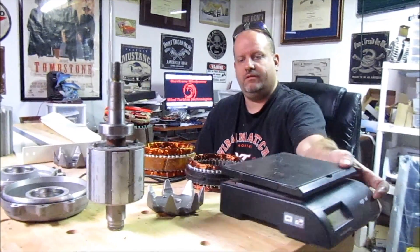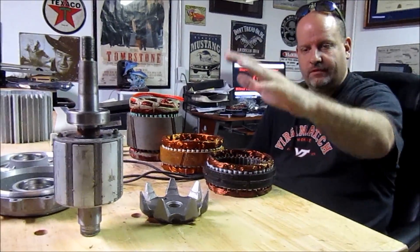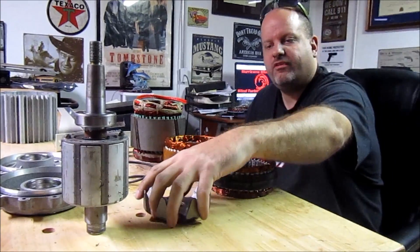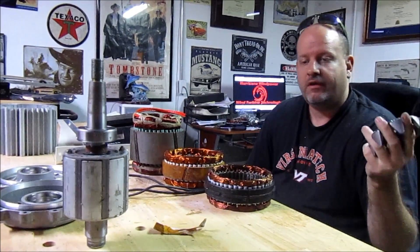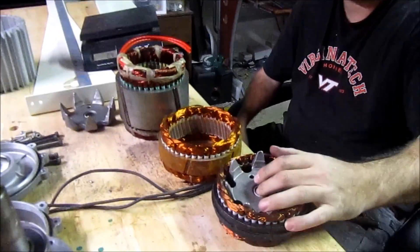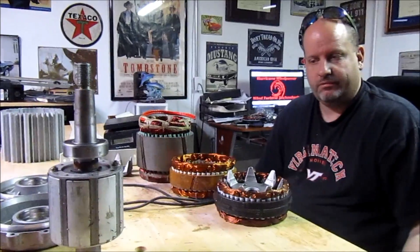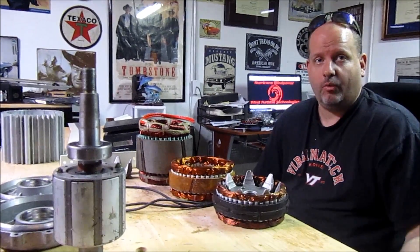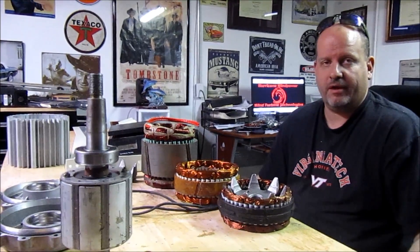So a few things that we have here on the table. This is a Delco 12SI stator core that we have on the table here. This is 14 poles — the magnetic poles that turn inside this alternator is 14. There are 42 coils in this generator. These generators typically have a 17 millimeter shaft and they've been being rebuilt and used for renewable energy purposes for about 10 to 15 years, quite a while. There's nothing wrong with these generators — I've made lots of videos about them in the past.